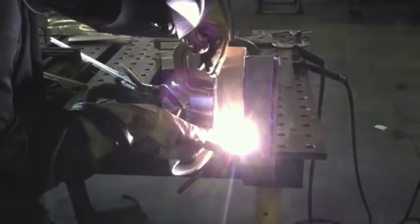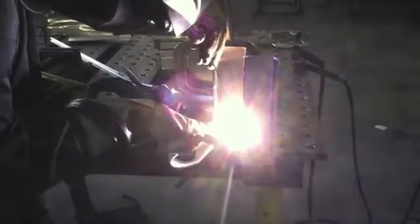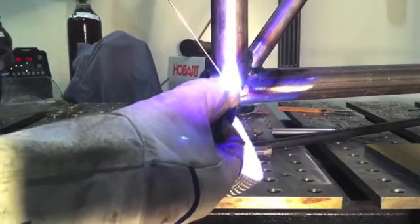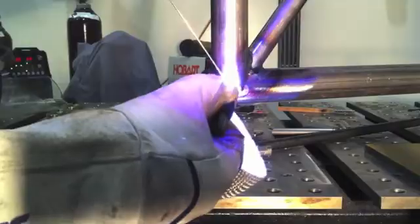Okay, one more thing. On the inside corner, or even a T-joint, the heat gets trapped and it'll really cook your knuckles sometimes. So this is a good way of propping to keep your knuckles cool. And on 4130 chromoly, like if you're welding a fuselage for a small aircraft, it's the ticket. Hard to find places to prop, and that stuff does get hot. TIG finger is the way to go. You can prop right next to the weld if you want. A steady hand does weld better.